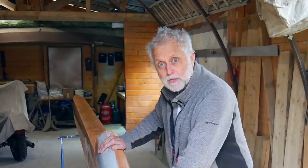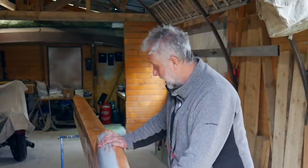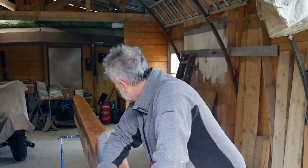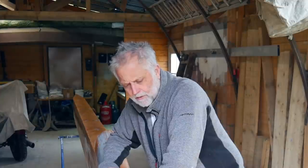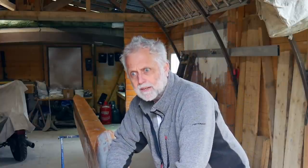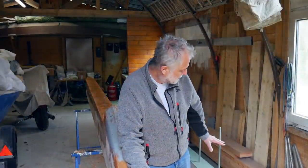That is now in position and I've started glassing up. I've got a good heavy biaxial tape down the front there. Then I'll be laying flat biaxial cloth on either side. The whole thing will be completely encapsulated in glass and epoxy, and a fairly heavy one at that. So that's coming on well. Still got that aft raised section to go, but I do believe that'll go quickly, as it's a big chunk of wood. It's not particularly complex. I also put a few coats of zinc rich epoxy on the ballast keel, on the top and on the bolts, just to seal those and protect them.